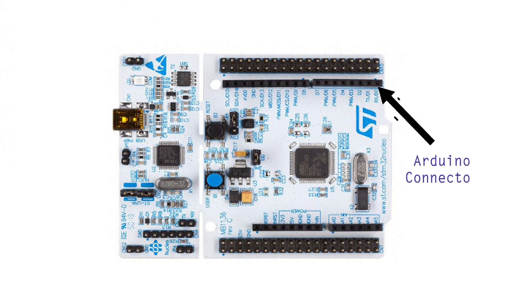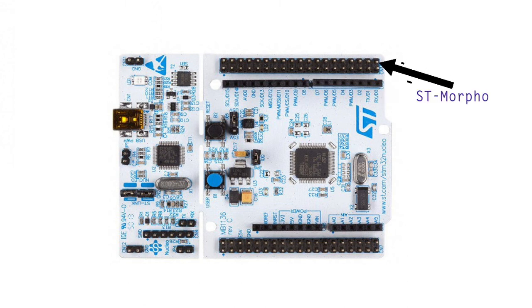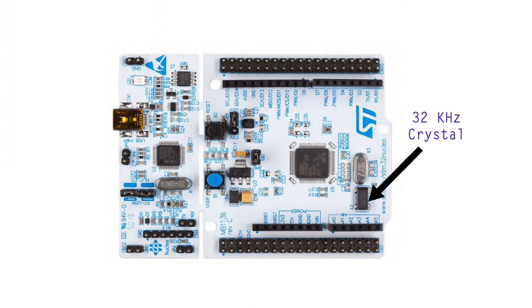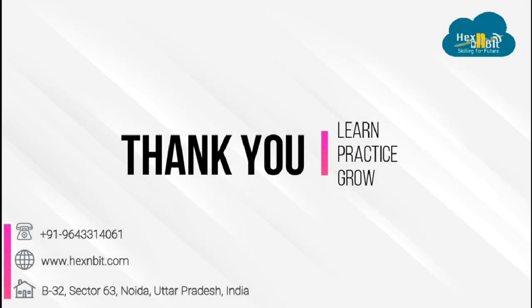Next is a green color user LED. There are two types of connectors available on the board: Arduino connectors that support UNO compatible shields, and ST Morpho connectors, which are used to access the input/output pins connected to the MCU. Next is the MCU STM32 F401RE. There is also a 32 kilohertz crystal used for the inbuilt RTC. That's all for the board introduction.